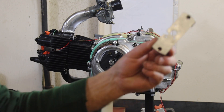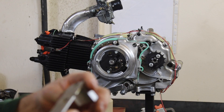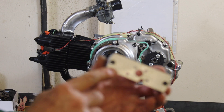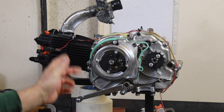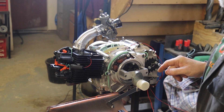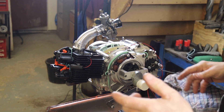I'm going to get this lot degreased and cleaned up, lacquer it, spray the socket black, etch-prime it and then black it so it doesn't go rusty, then assemble it. I'll countersink all those holes so I don't need huge 40mm long bolts to hold it all on. The motor's on, had it all working. I'll get the camera off the tripod and bring it in so you can see it all go round. We don't actually need the motor speed controller — it just gives you a ramp up to start it rather than full 12 volts straight away — because flat out it seems to be about the right speed.